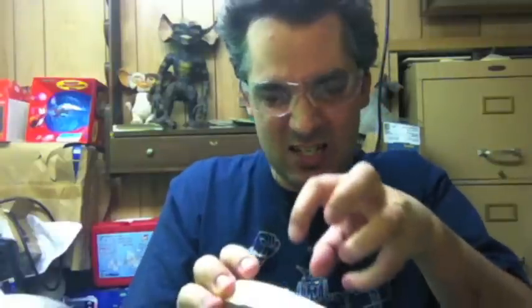A number of things went wrong with my little plaster assembly of the O-ring that I was putting between the two halves of the infinity mirror. What I didn't take into account was that plaster is very porous, and when you put epoxy in there, it doesn't really matter how much mold separator you use — it just goes in there and it sticks, and it's horrible.